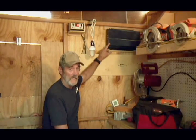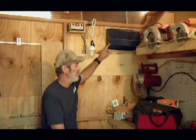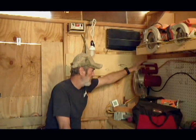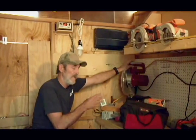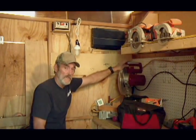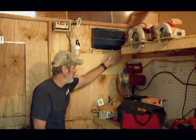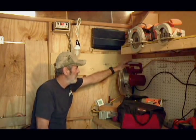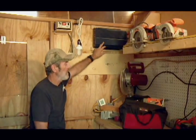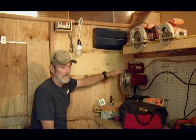The inverter that I've chosen is a 2,000–4,000-watt inverter, and the reason why is when you run the big boys, these are 15 amps. The formula to remember is amps times volts equals watts. So if this pulls 15 amps under load at 120 volts — everything plugs in at 120 — that's 1,800 watts. So this 2,000 to 4,000-watt inverter will run it, or any of the other tools that I'm going to show you.